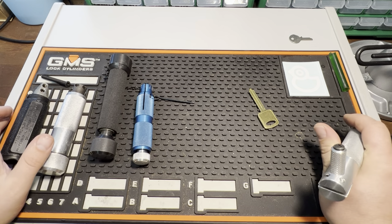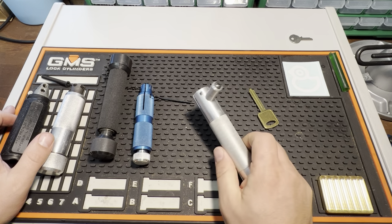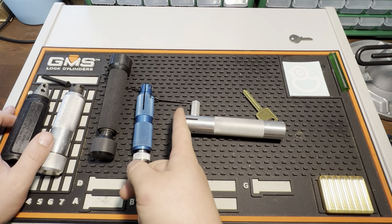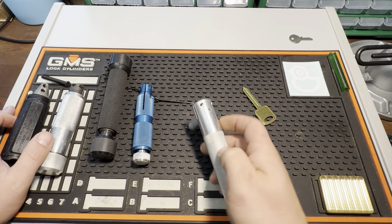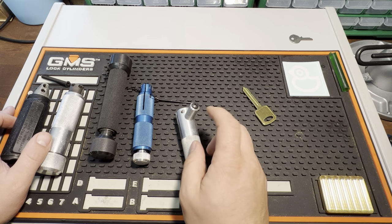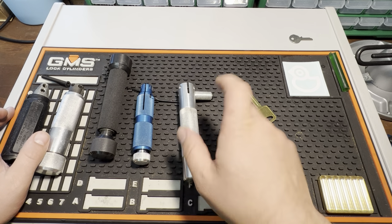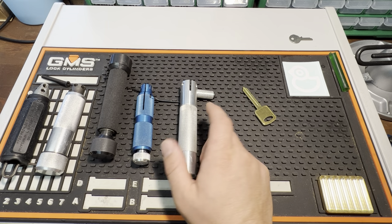There's also DIY stuff. There's a tool you can get from Harbor Freight or Alibaba or other importers — it's a windshield removal tool. There's a handle that would normally have a blade stuck in it. You can take this handle, take a hacksaw, cut it down. You don't have to add a chamfer or anything, but you can. Then you just drill and tap two holes and this can hold your key blank. If you're enterprising, you can cope a little piece of aluminum and get it in there. I did not make this one, but I know how it's made.